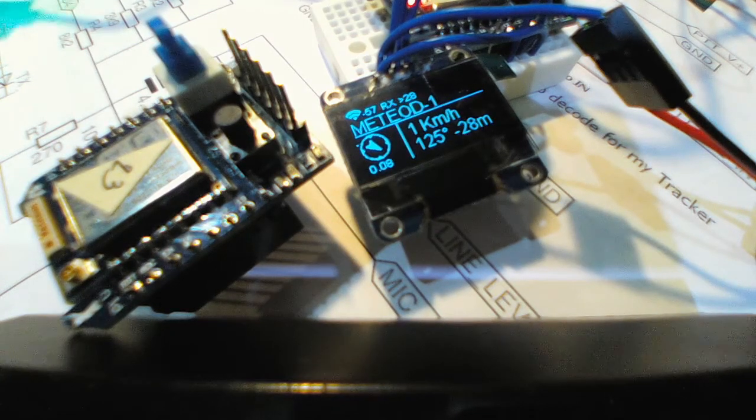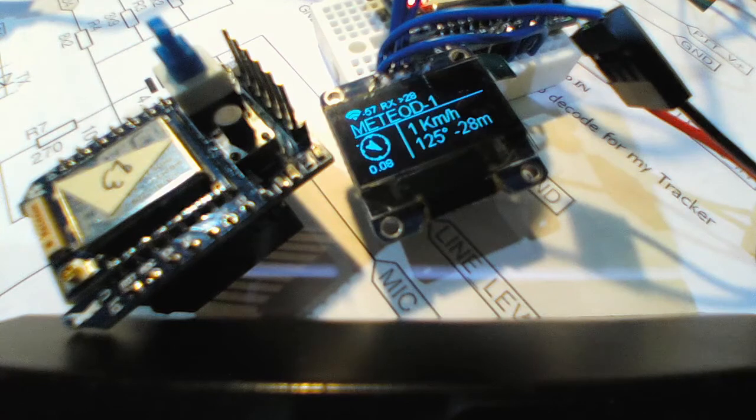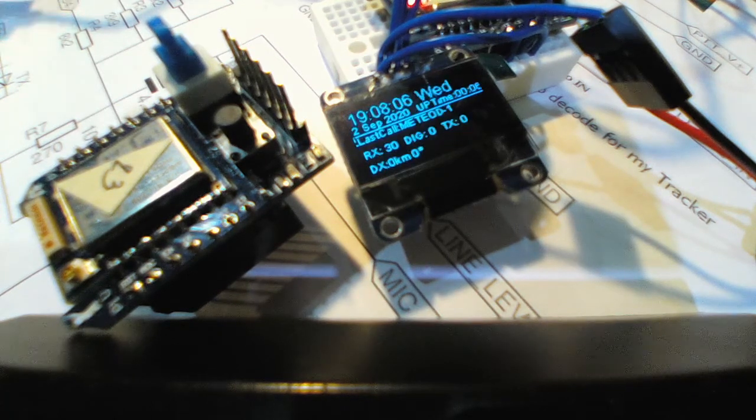Because of KISS mode, you can get the command from the iGate, and the iGate will send commands to send the PTT, and also audio. That is the resistor, like a ladder, to get the AFSK out. This is a volume control to the microphone, and this is coming in from the speaker of the radio and gets into here. I changed this 10K to only 2K, a voltage divider, so it worked fine. So this is how it works.